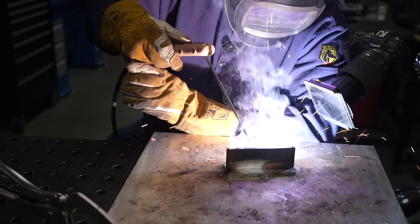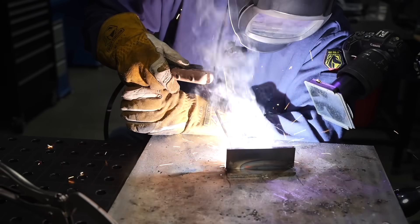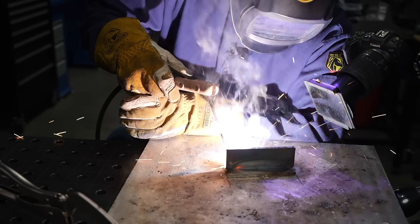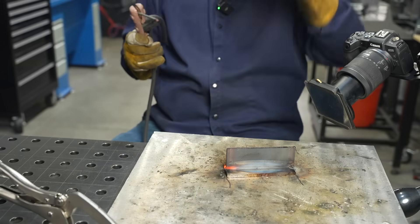When I weld with 6013 I can just move steadily along and feed my electrode in. Notice I'm propping with my left hand to help guide the rod smoothly. There is some spatter you'll get from 6013 — that's just the nature of how the electrode runs. Notice that bright spot is your weld puddle, and behind it where it's more orange is the slag following over. Sometimes that slag can get mixed in with the weld puddle — that's the biggest drawback. When that happens you can end up with it welded on just one side with slag baked in; usually you can correct it by turning up your amperage a little bit.